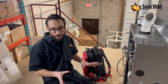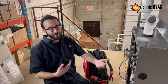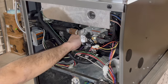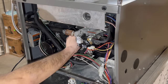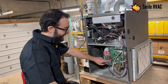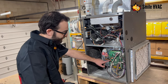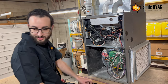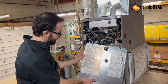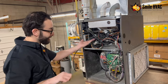Here we're going to show you the different kinds of codes and blinking lights you can have on the furnace — to know if it is in fact an error or if the furnace is operating normally. In this situation, I removed the tube from the pressure switch system, and now the furnace has failed out on an error code. It's going to show H for heating, but it will continue into E227, which you can see on your error code list. E227 has to do with low pressure switch opening during ignition, which is exactly what we set it to do.